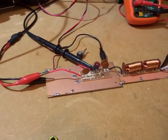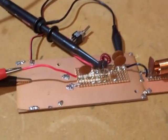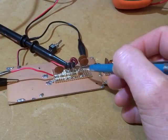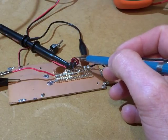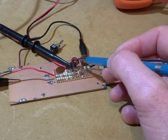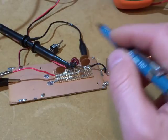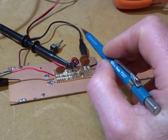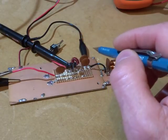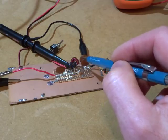In order to tune this, I played around with the frequency of the signal generator and looked for a peak in the output — trying to find the exact resonant frequency for that inductor and capacitor combination. It kept turning out that the resonant frequency was a couple of megs lower than 7.025 MHz. As we know, the frequency of oscillation equals 1 over 2π√(LC), so reducing L or reducing C would allow the frequency of oscillation to increase. I played around with that — initially the capacitor settings, then later the inductor. As it turned out, the inductor didn't vary by too much; I dropped two turns off.